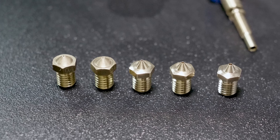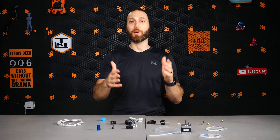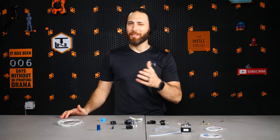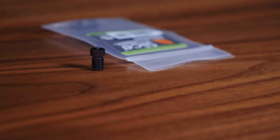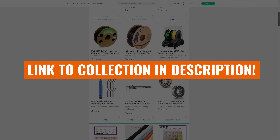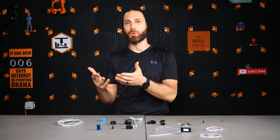This means that currently I'm keeping three to five different nozzle diameters in two to three different materials and two to three different lengths, plus volcano adapters in case I want to use a specific nozzle on a high-flow volcano printer — not to mention specialty nozzles for the Bambu Lab printers. Most likely you don't have this many printers, and you don't always have to buy the $30 Slice Engineering or Bondtech nozzles. While I do use those for specific abrasives, many of my spare day-to-day nozzles are just AliExpress ones and they generally work fine too — and if you buy those, they are really, really cheap. As with everything on this list, I'll leave a link in the description to a special Kit.co collection where I'll be curating a list of my recommended replacement parts and which stores you can buy them from.